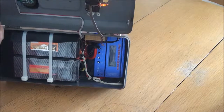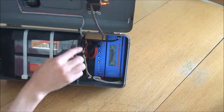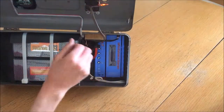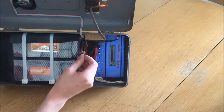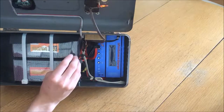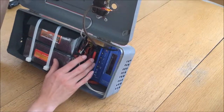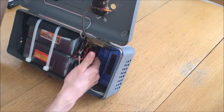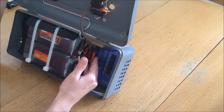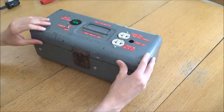I have a two-pole toggle switch for turning the power on and off. The first pole simply turns the voltage display on and off, but the second pole is wired to the inside of the inverter. I had to take the Chicago Electric 750-watt power inverter apart to install the switching, and reconfigure the control circuitry a bit because they had a dual pole switch built into the control circuit. I wasn't sure if it was going to perform that well since it's a cheap inverter, but I've been using it for six months through some pretty intense duty use and it has been very reliable — no problems at all.